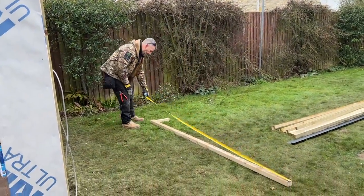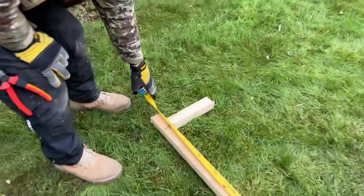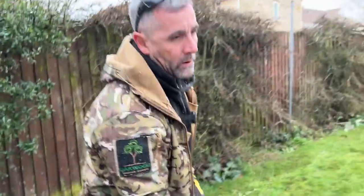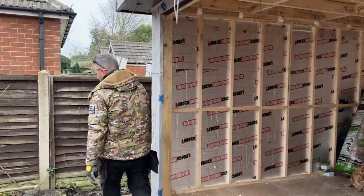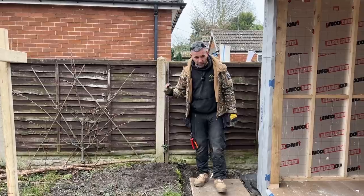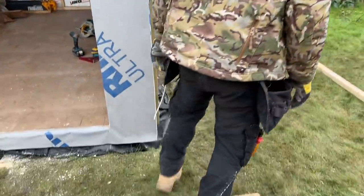If you see that there, David, look. Yep. 2.5, that is the permitted development height you can build under. And our building, of course, it's taken from the highest point of land. This here would be the highest point of land, but the customer's going to get all this flagged, so that will be gone, so we can't reference off that. So what we decided was this was the highest point of land just there.